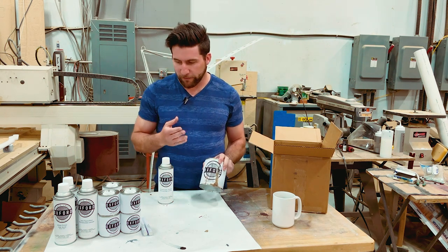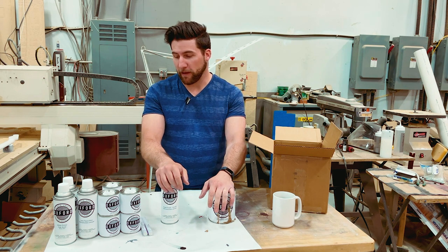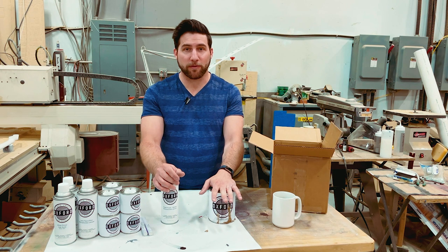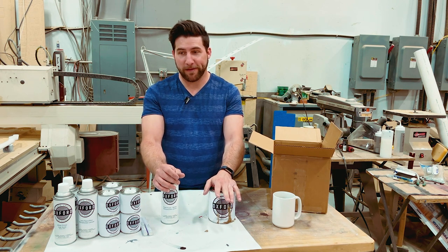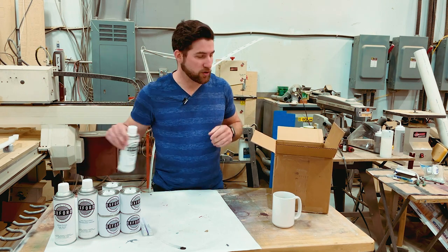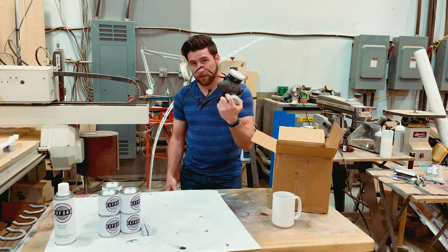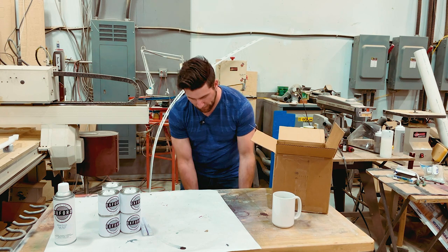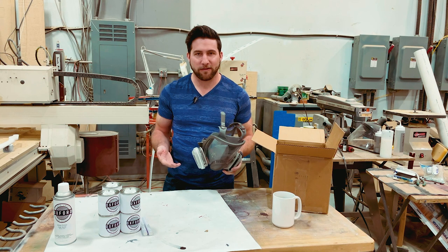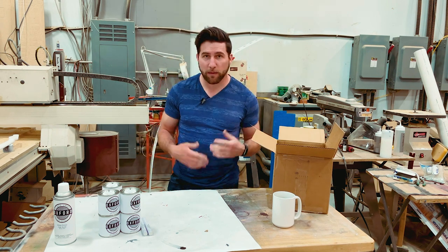If you're at all interested in picking up some Oxford, check out the link in the description. Feel free to put my name in under the 'how you heard about us' part — that helps me out. Make sure you're protecting yourself if you're using this stuff though — it is nitrocellulose lacquer, so it's fun, easy to repair, and pretty, but it smells horrible. Make sure you're wearing a mask — not a dust mask; you need something with a fume protector. A half mask works in a well-ventilated area, but a better option is a full-face mask. I have both options linked in the Amazon link in the description.